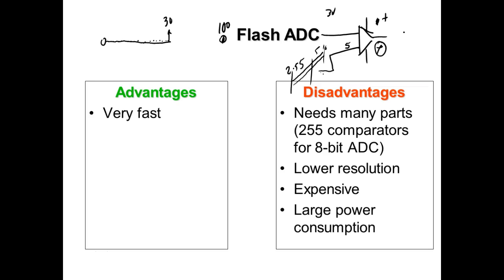So instead of starting at zero and ramping it up until you find it, we start in the center, right? You understand? And then if the output of my comparator switch is negative, I know I'm below it. If it switch is positive, I know I'm above it. And then we bounce around in it until we find it. The advantage of these is that they're faster. But to you, it really don't mean anything, right? Because all you're doing is taking the output of this guy and generating a count, depending on this value right here, which is pretty neat. We'll talk about that in a minute.